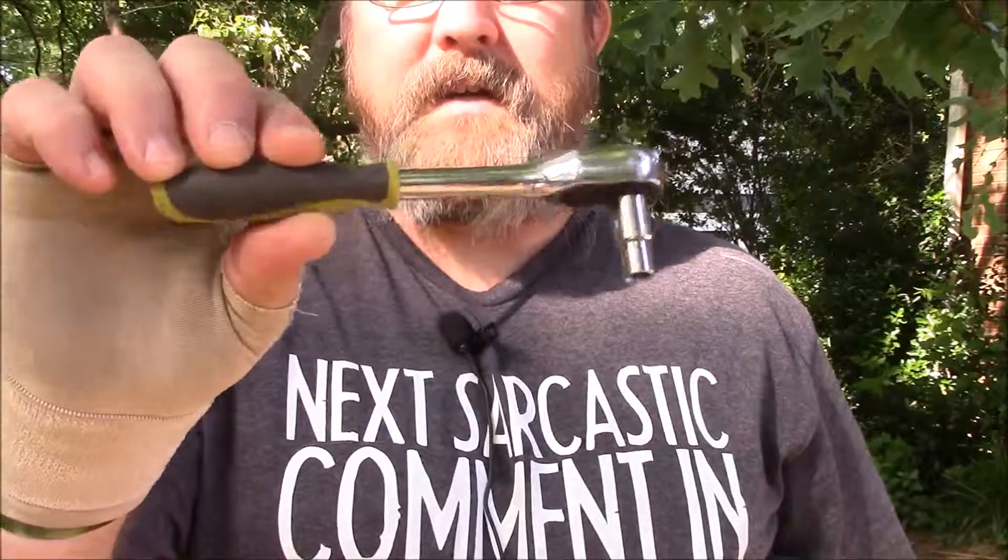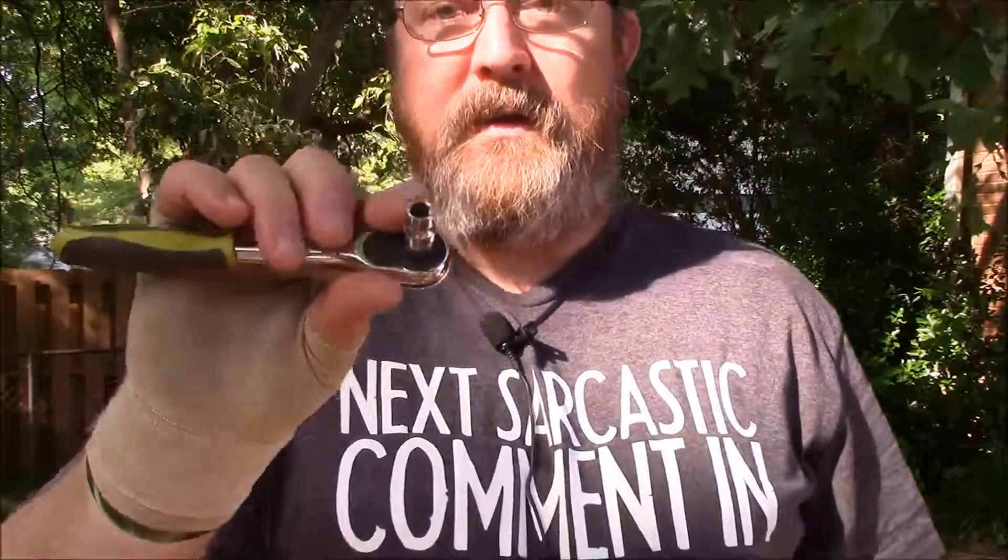Today what I wanted to do is show you how to take apart some of these gutters that I got. There is metal in them, but it's mostly aluminum so you can get the better aluminum price — old sheet aluminum I think is what they call it — if you get the steel out. Basically the tools you will need are this ratchet right here, a hex bit — I think it's a quarter-inch hex bit. Other gutters may use different sizes, but most of the time your screws are going to be steel.